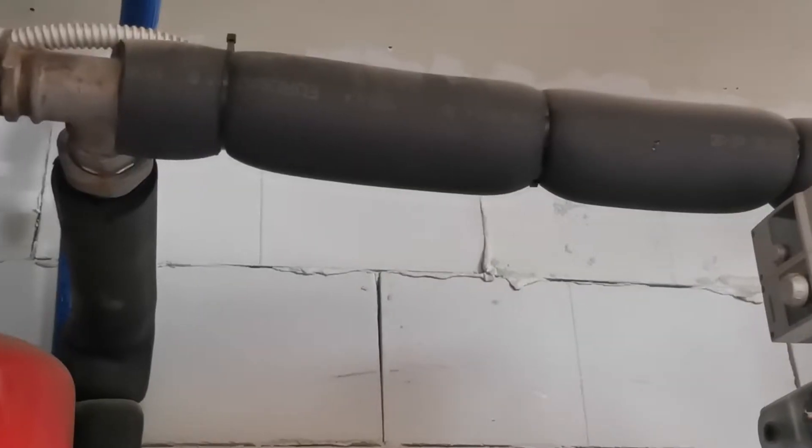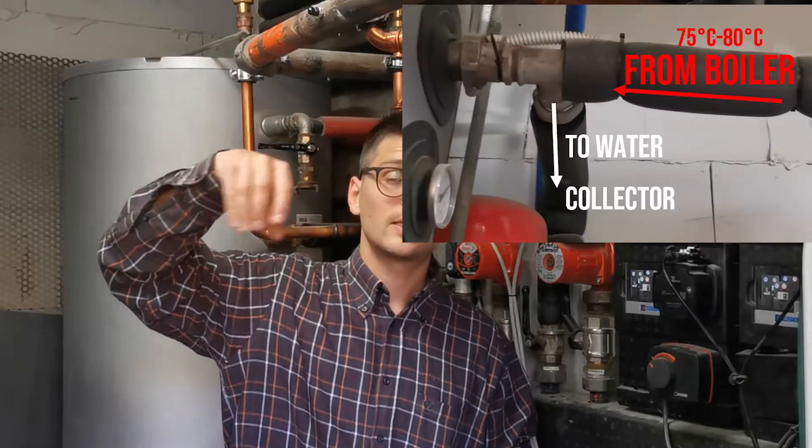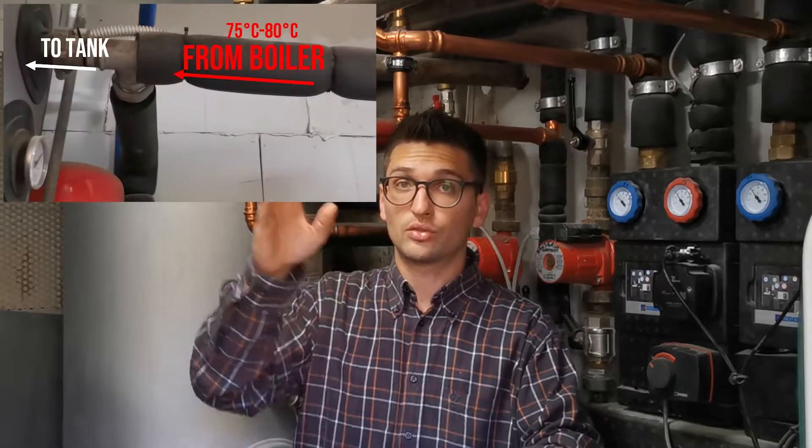After this you can find a very simple but also very important component: a T-connector. The first thing to do is to heat up the house — it is the highest priority. Pumps are running, they require hot water from the boiler, so the water takes the perpendicular branch and goes to the water collector so that it can reach radiators inside the house and heat it properly with high-temperature water. Then, once you have reached the desired temperatures in your rooms, pumps are not running anymore and the hot water from the boiler now takes the straight path.